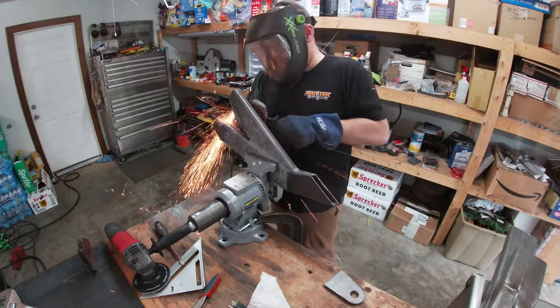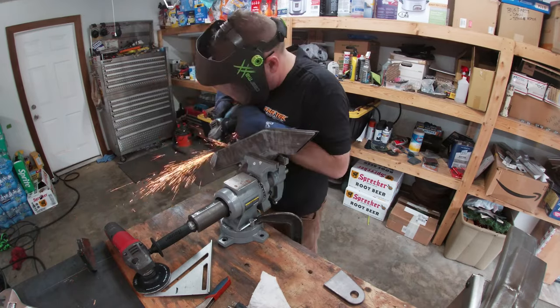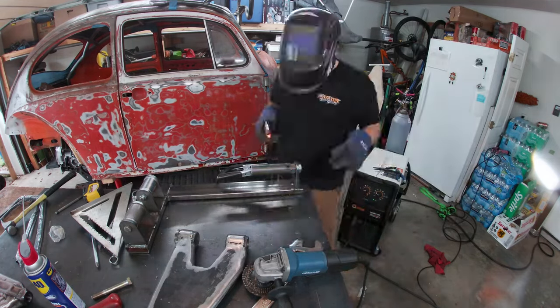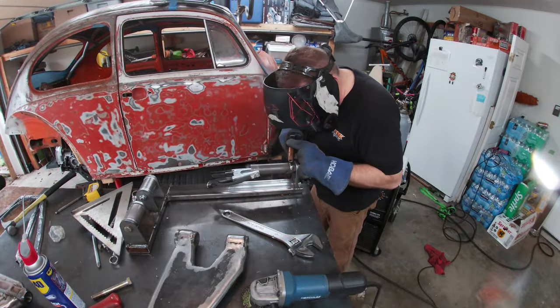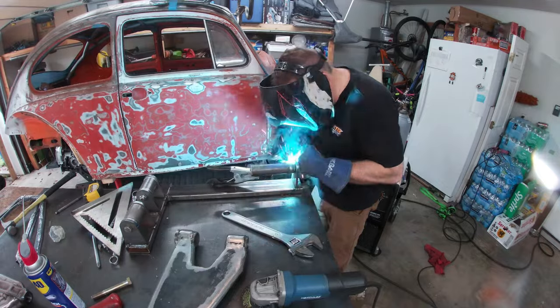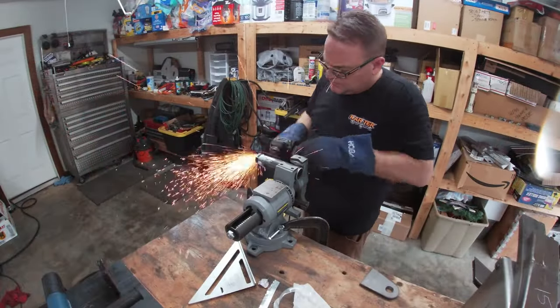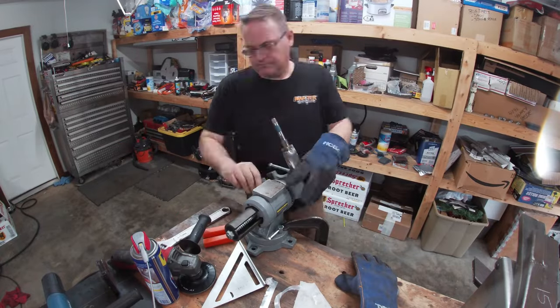After welding, I had to sand everything smooth so that the plate would sit flat on the arm. I also welded in the bung into the DOM for the heim joint at the steering knuckle. Then after sanding that smooth and letting it cool, I ran the tap in and out just to make sure the threads were clean.